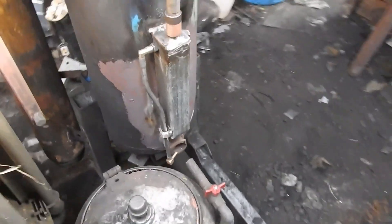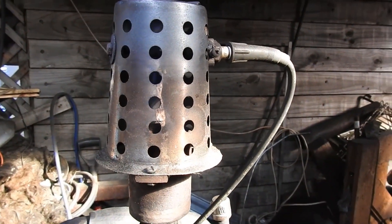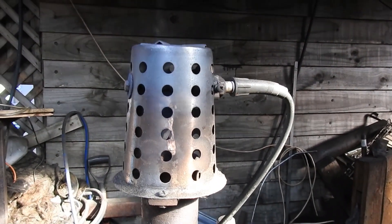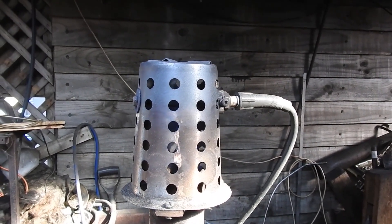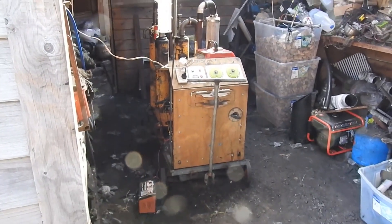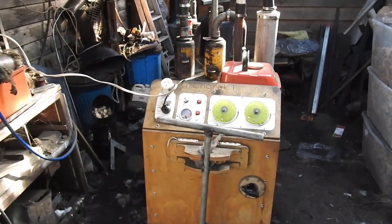Okay, a lot of that steam got lost, but some of it got sucked in. Whether we're going to see a difference here I don't know, because there's too much ambient light. But we will definitely notice the difference when the engine is drinking that water. Running on a very lean mixture because the charcoal is nearly all gone, but when I throw some water in there you'll notice the difference.